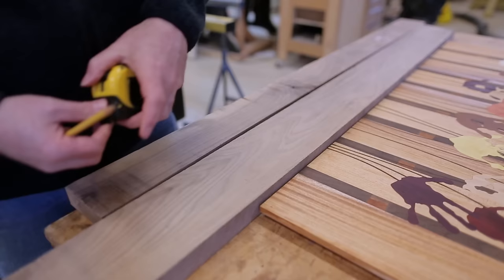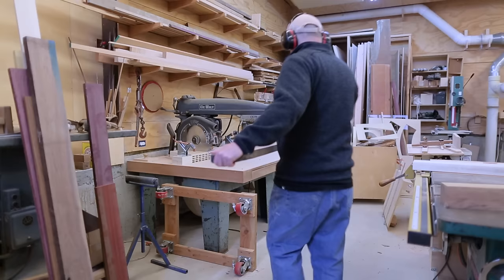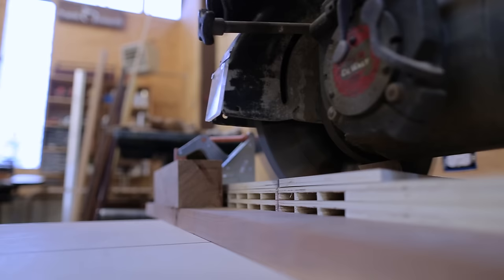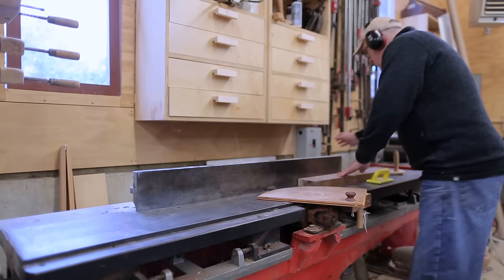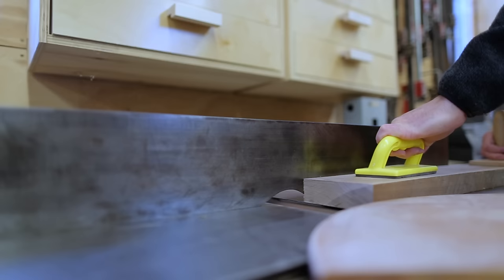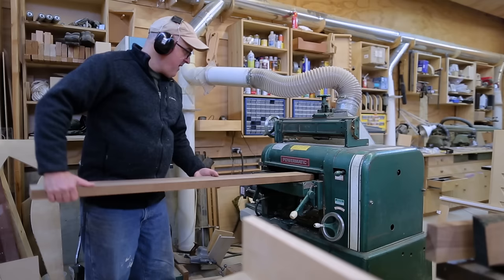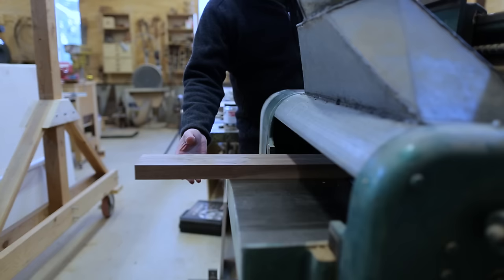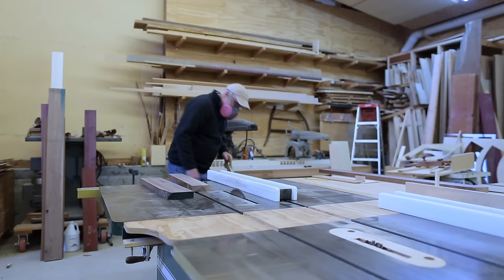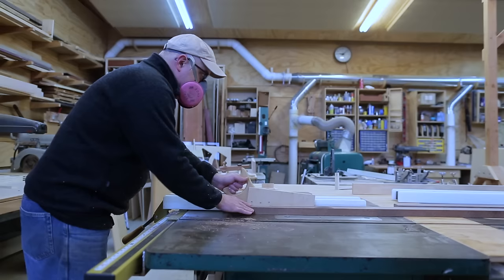I took some time measuring, really being sure of the pieces I needed — I had only one chance to make this. I cut the longer piece into the two pieces along the top and bottom and one of the vertical pieces. Then I straightened all the parts: I jointed a face and an edge, then planed the opposite face. The jointer makes one face flat and the planer makes the opposite face parallel to the first — that's why you need both machines. Then the table saw makes the edges parallel, so I can rip the long pieces in half.